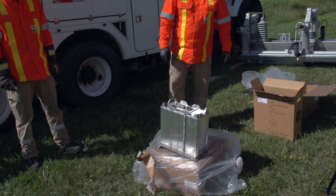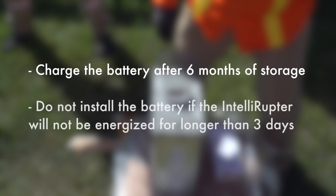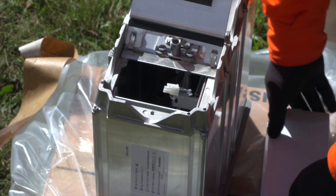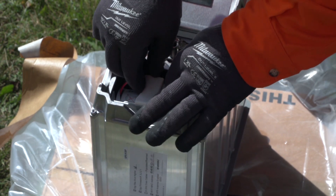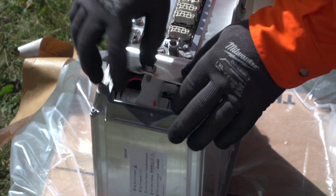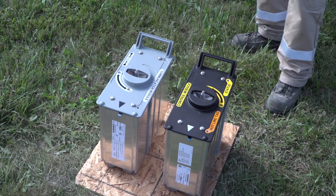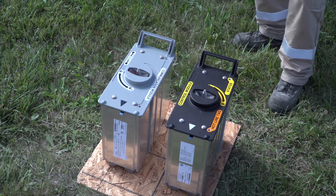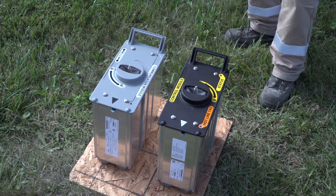The first step in installing the communication module is to install its battery. If the Inteliruptor Pulse Closer Fault Interrupter has been in storage for more than six months, the battery should be charged. If the Inteliruptor fault interrupter will not be energized for a period longer than three days, the battery should not be installed at this time. To install the battery: open the compartment, insert the battery, connect the connectors, and push the battery all the way in. Then close the battery compartment cover and secure the locking screw. A radio providing wide area network capability for SCADA applications, if specified, is furnished factory-installed in the communication module. See the written instructions to install a different radio.